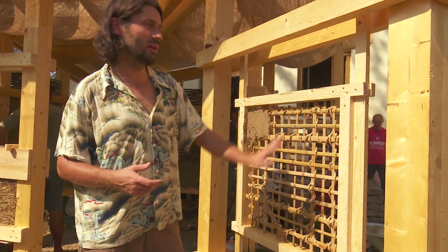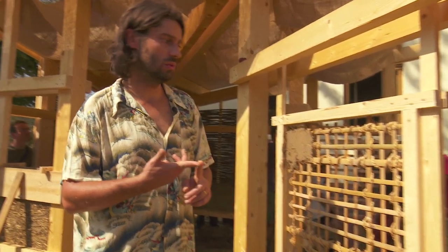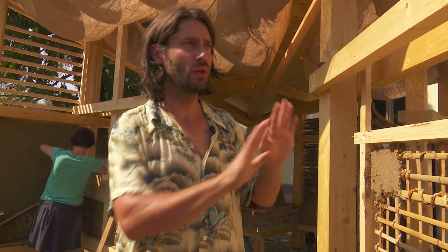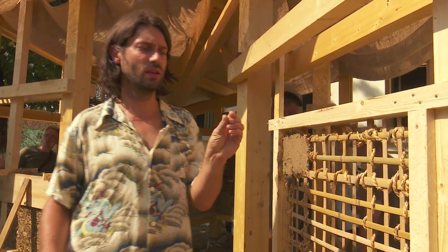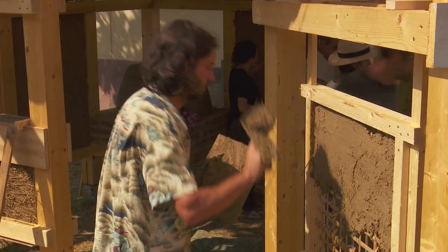And then you have the finishing layers, which can be either colored earth, or sometimes you use lime. So you have a white finish. But even lime has fibers inside and has some glue from seaweed, which helps to create a very dense surface, so this lime can also stay for 20, 30 years. You don't have to remake it. And it's also applied with trowels. It's not painted. So it's thick, it's like a plaster. It's a thick 2-3 millimeters layer.